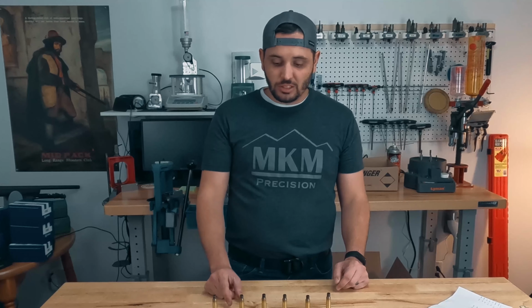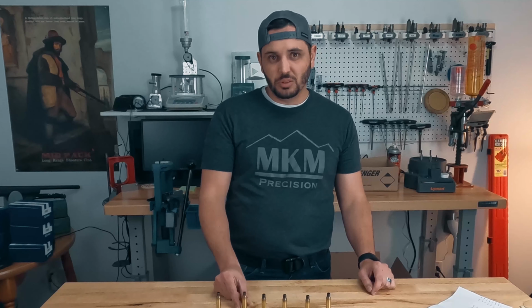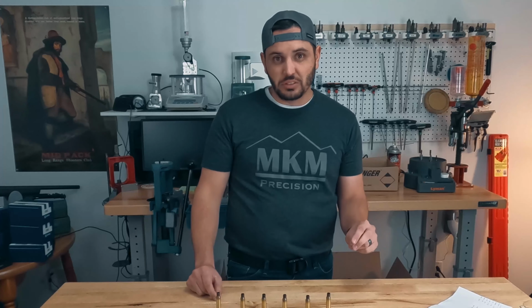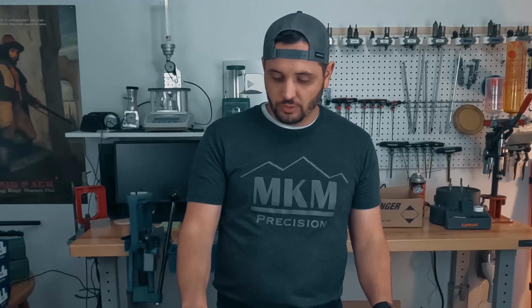Is it just simply a matter of, can I get it to be as consistently hard as possible? Which I think this does. When we get down to somewhere that is flattening out on our S-curve, I think that gets us much better sizing results and much more consistent hardnesses. But what hardness do we take it back to? Where do we go from there with it?